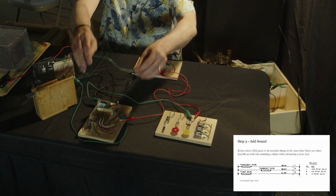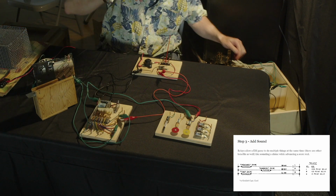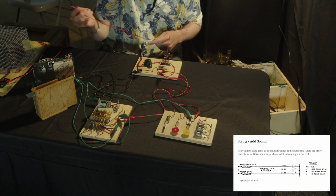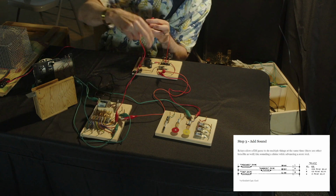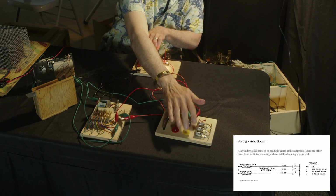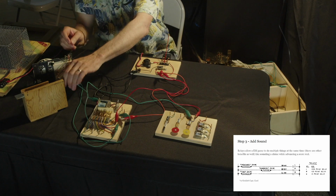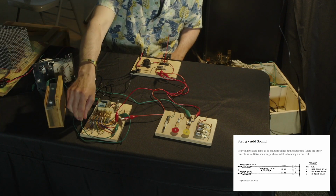to get over there. So if you are working on your game and the score reels are working great, but the chime isn't going, you can look at that relay. There is a switch on that relay that's just there to complete the power circuit to the chime. And again, this is a simple example, and we're only looking at a one-player game. When you get to a multiplayer game, the chime actually remains pretty simple.